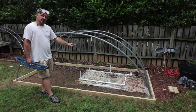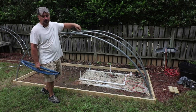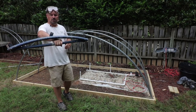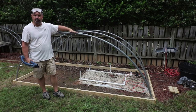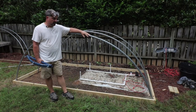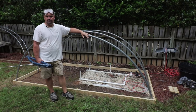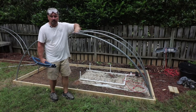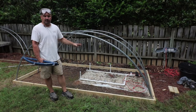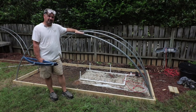If you want to build the little PVC one I built last year as an alternative to building this metal one — this is just out of the top rail from a chain link fence. I did a video using a simple pipe bending tool to show how to bend these top rails into hoops. This is very inexpensive material, a thin gauge metal, so you're not going to build a professional 100-foot long greenhouse out of this. A serious storm could still damage this, but it lasts much longer than PVC because PVC breaks down in the sun and ends up cracking. This won't do that, but it would need to be protected from heavy snow loads.